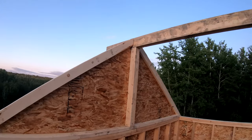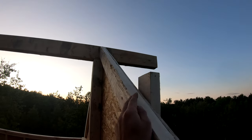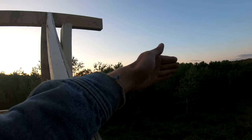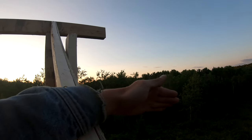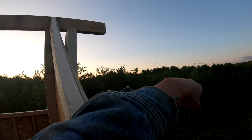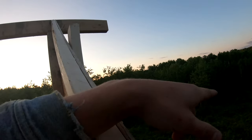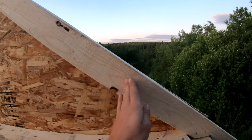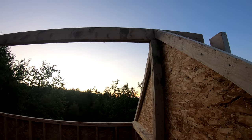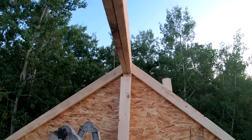I marked it and lined up both sides so I have the exact same two-foot overhang on both sides. I'm going to need to do the horizontal overhang boards — I can't remember what they're called — from this rafter to that rafter. I realized I'm going to need that area open in order to bolt them to the outside rafter for the overhang. So I shouldn't put in this rafter yet — I should wait a little bit longer before I do my wall framing here. Check that shit out — real deadly.